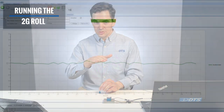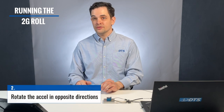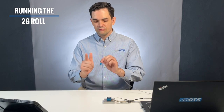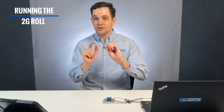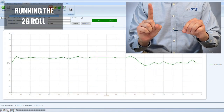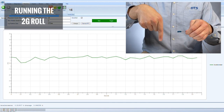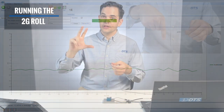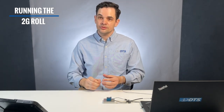Once you've done that you'll see close to zero in real-time. We'll then rotate the accelerometer into the two different directions. Let's say that positive happens to be this way — I'll take the accelerometer and face it up. This is just the positive direction; it's just the polarity of the sensor, something you can probably change based on what software you're using. But if this is positive we should see 1G. If we rotate it the opposite way we should see negative 1G. Altogether that's 1G at the top, 1G at the bottom — 2 total. So if that's what you're seeing on your screen, you know you've run a successful 2G test.